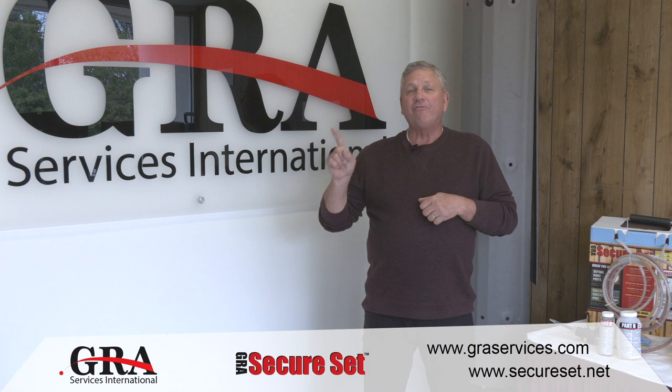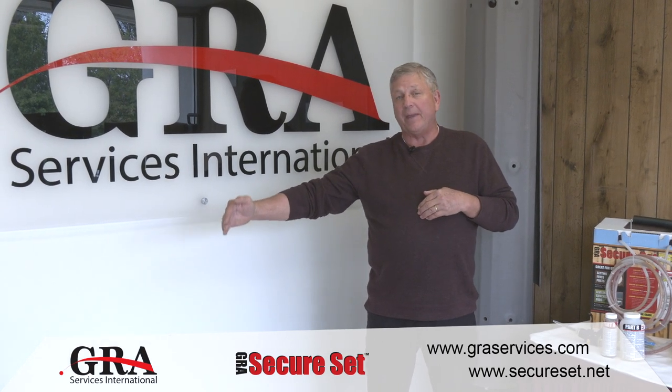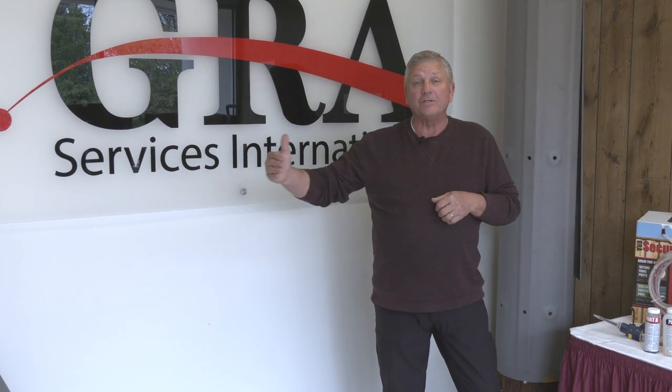The tip of the tower will lean 54 inches away from the base of the tower. That means that the base cannot be compromised when that load is on the tower. So what we've done is we've erected the tower, we've attached ropes, we've pulled the tip of the tower, we've set a plumb bob so that you can see the advancement of the tip to a point 54 inches away from the center point of the tower. We even went beyond that, actually, we went to 60 inches to make sure that the tower could withstand even more significant load.